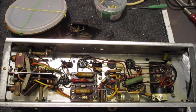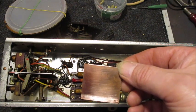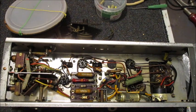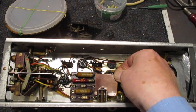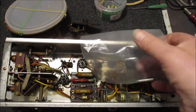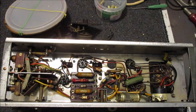Before doing the continuity tests I measured and cut a square of copper clad Paxolin board. Once I've plotted out the print and etched it in ferric chloride solution, 0.8mm holes will be drilled into the appropriate locations, and two 33 microfarad electrolytic capacitors will be soldered in place onto it. That printed circuit board will be located here, directly above the old existing dual electrolytic capacitor canister, achieved using two metal standoffs.